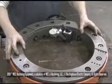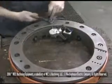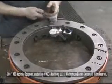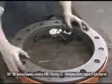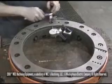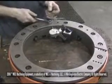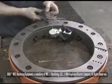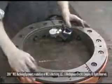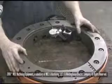Then we'll go 45 this way. Break the nut loose. Turn it to the left till it touches. Snug it down. 45 this way. 180 degrees across. Break it loose. Turn it to the left to touch up on your V-groove. Bearing on your V-groove, snug it down. Right now you've already got resistance in the machine. You feel the bearings rolling, it's not running free anymore.